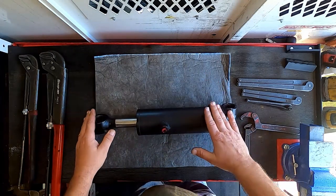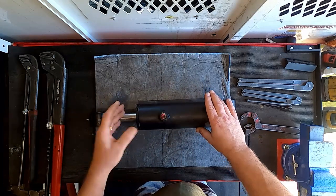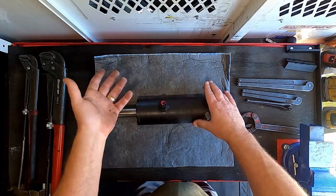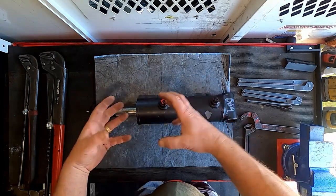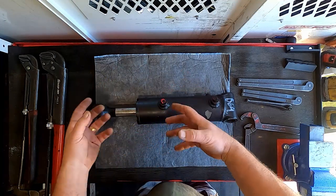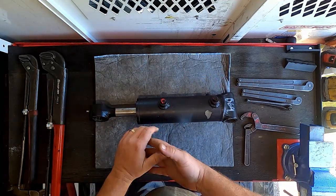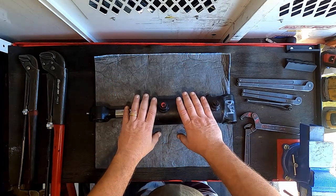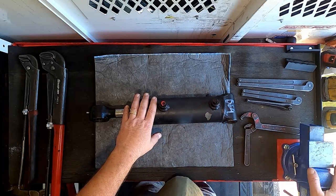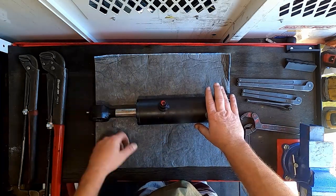It makes for a good example. Like I said, if you get to the point where you're not a hundred percent sure how it comes apart, see if whoever you're buying the packing kit from will give you a parts breakdown of the cylinder. Some of them are pretty good and will actually show you an exploded view and give you an idea of how it comes apart. Or you can just go on YouTube and find someone who's already done it and they'll show you how to do it. So let's get this thing mounted up in the vise and we'll crack this bad boy loose and start pulling it apart.